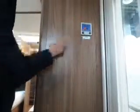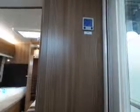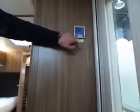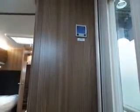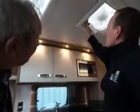On this one you can prioritise either gas or electric. So if your main screen is showing, say, 30 degrees, and obviously it's a lot colder in here, the heating's not going to come on because it thinks it's already at that temperature. So with that calibration button, you can actually reduce the temperature as it's shown on the screen. You just touch it and it switches it on and off.